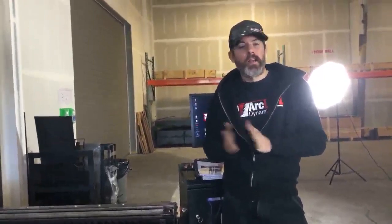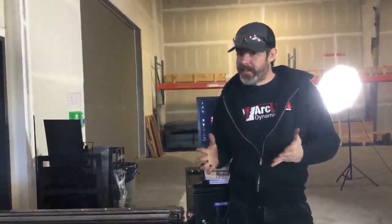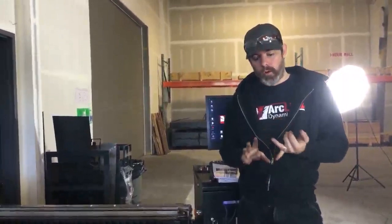It's important that you ventilate any gases created by cutting aluminum. If gases from aluminum cutting get trapped and get pocketed up, those pockets can then ignite and cause small explosions. It's not going to be a fatal explosion or anything like that, but it'll be a little pop, pop, pop. That'll move your aluminum plate around, and that gets expensive because it messes up your cuts. So it's a good idea to open up the bay door or set a box fan next to your table when cutting aluminum to help ventilate those gases.